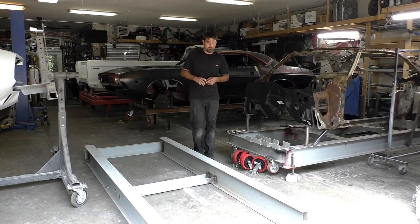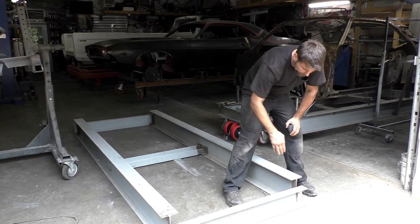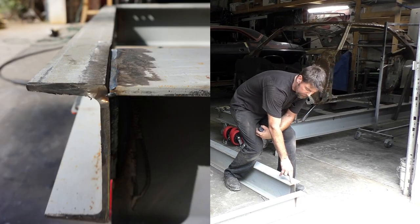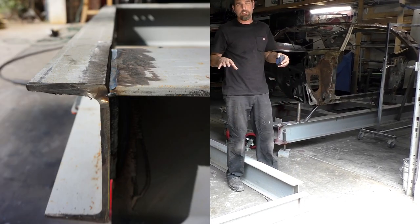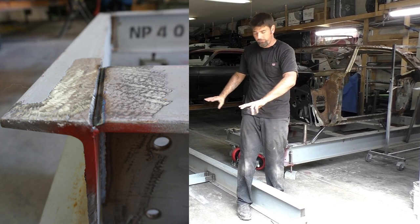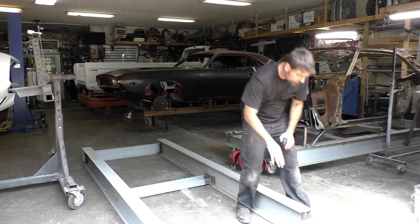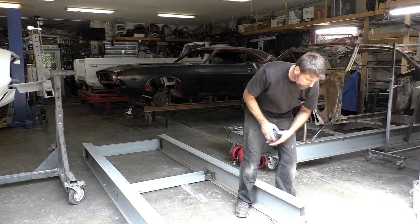What we did so far - if we flip it over, I actually had to cut and grind into the top of this I-beam because we want our penetration on the welder. This is the max thickness my welder was able to weld. So if you have a 110 welder, forget this - it's not going to work. Check with your welder settings. You could put a relief, grind in there to really get good penetration.